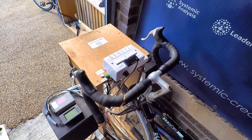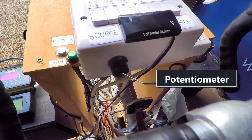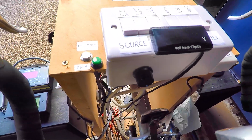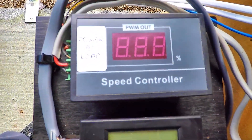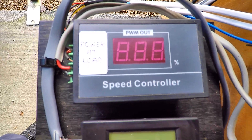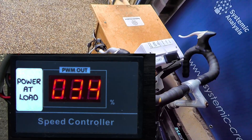As you can see we have a controller — a potentiometer mounted onto this switch box. Using this we can control the percentage power available to the kettle or the load, and the percentage is displayed on the pulse width modulator display. The reason it says 'speed controller' on here is because this device is designed for a DC motor, but it works the same as any other pulse width modulator and I can demonstrate it whilst connected to a battery like this.